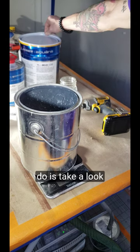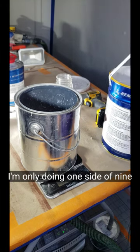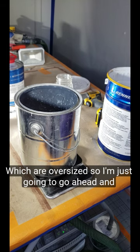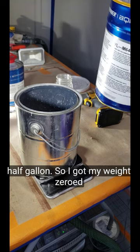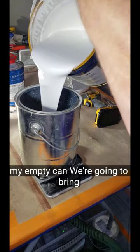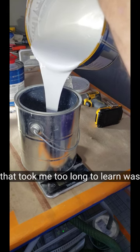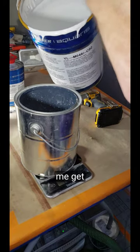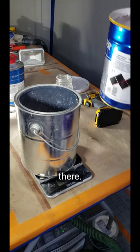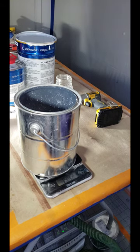Now what you're going to want to do is take a look at what it is you're spraying and how much you're going to need to get your coat on. So I'm only doing one side of nine pieces, two or three of which are oversized. So I'm just going to go ahead and mix up probably half of this gallon. So I got my weight zeroed out. I'm going to pour in my primer to my empty can, and bring it up in between these two ribs of the gallon. The little thing that took me too long to learn was that each of those ribs is actually a third of a gallon — so that helps to eyeball measurements. So I have half a gallon of my Renner 648 primer and the weight is one thousand nine hundred and ninety-two grams.